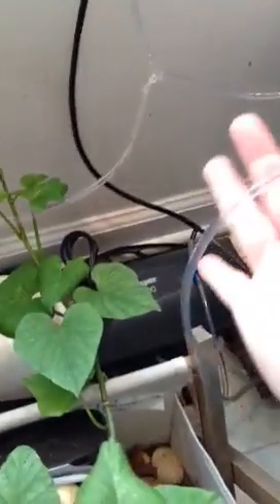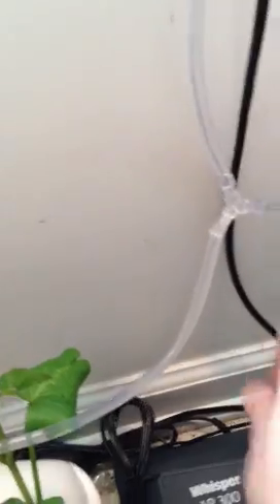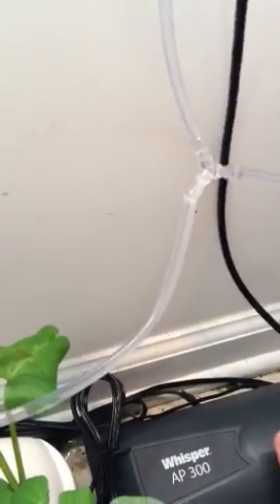When the system is shut off, water will sit into the airlift tubing. However, because of the water pressure in the reservoir, when it restarts, air does not back up into the water tubing. Instead it goes right into the black tubing, and because there's already a couple feet of water in the black tubing, it self-primes for me, making it easier — like a quick start.